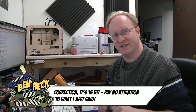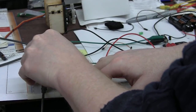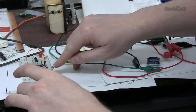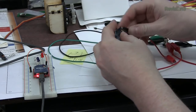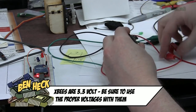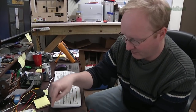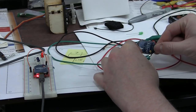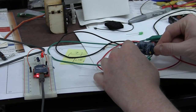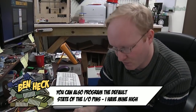Now we can do a test and see if they are interconnected. We're going to unplug one and put him over here, then plug the other back in. This pin right here is our data pin, so we're going to use that for monitoring. These batteries represent what's going to be in our mailbox. All we need are ground and power, and we have a 3.3 volt regulator. Now see this one has connected to it — I'm going to hit the complementary pin here. Pin 20 on this one is actually connected now to pin 20 on that one, so when I pull this one low, that one also goes low. Now the XBees know what the other XBee is doing.